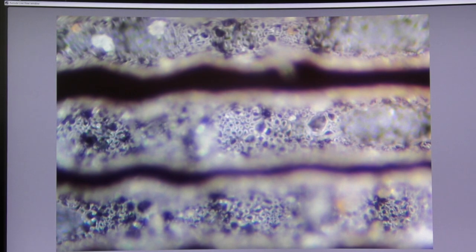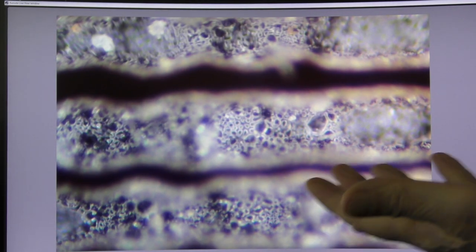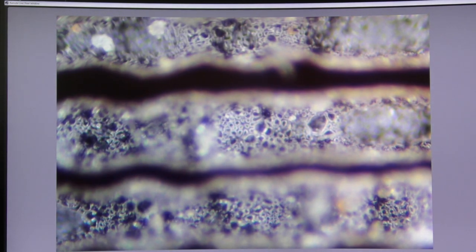Now, what happens is the acrylic boils at about 160 degrees C. And there it is. It's boiling. If you take it to 200 degrees C, it evaporates, and you don't get any bubbles. You just get red acrylic in the bottom of your groove. So there's a very careful balance of energy input that you need to create this bubbling effect without destroying or evaporating the acrylic. It can be a binary material if you get the balance of energy right.